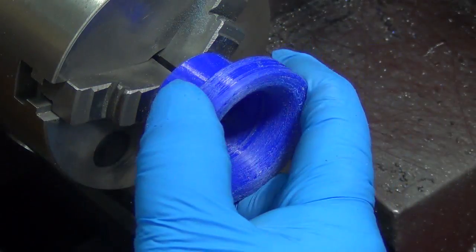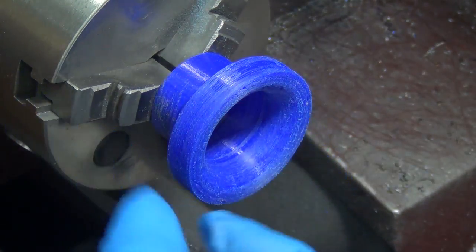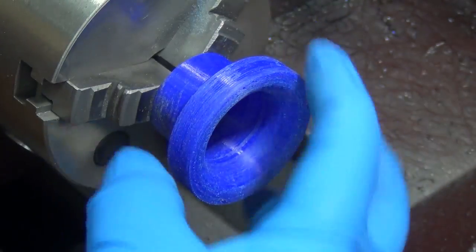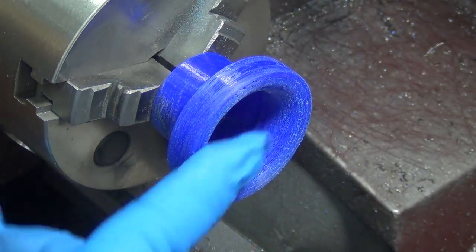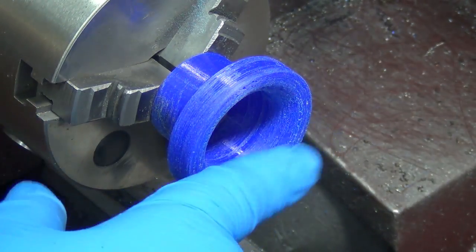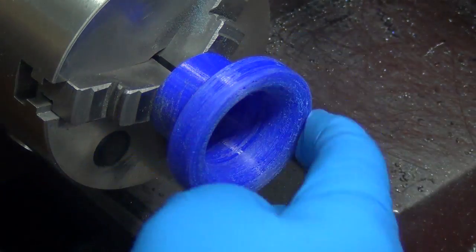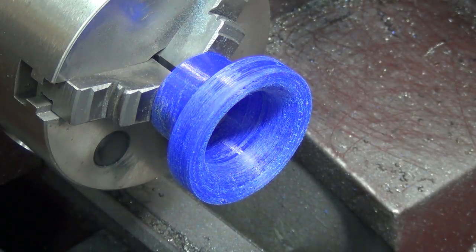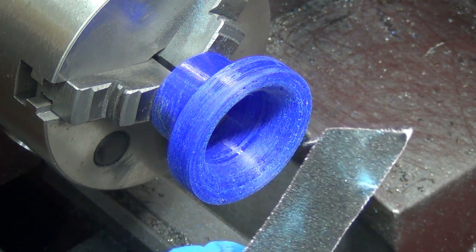It's on the lathe and it still spins a little bit — I didn't want to open it up and break it. We're partly seeing how tough it is, and also how nicely we can get it cleaned up. I've already hit it with the 80 grit and got the biggest roughness down and most of that mushrooming on the bottom edge. Now I'm going to hit it with some 120 grit; I think we're running around 1400 RPM.